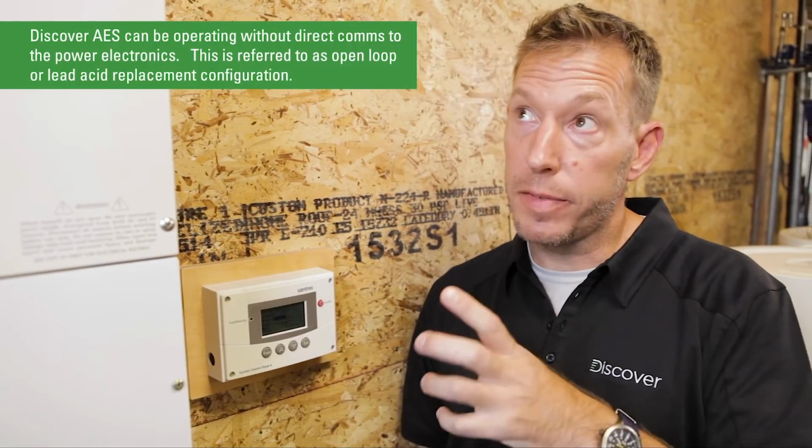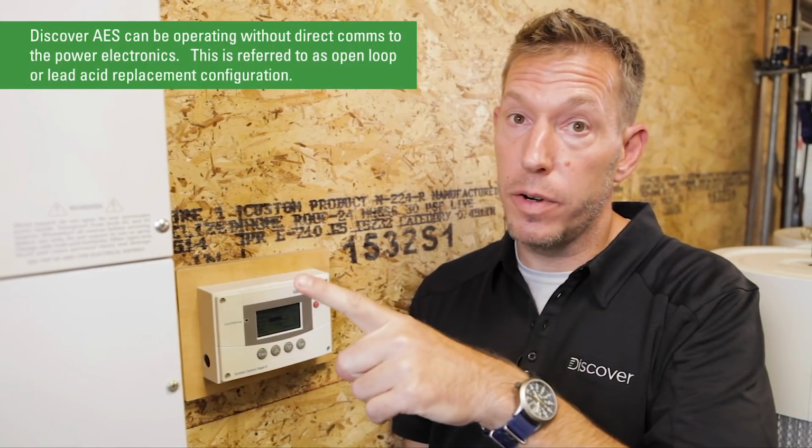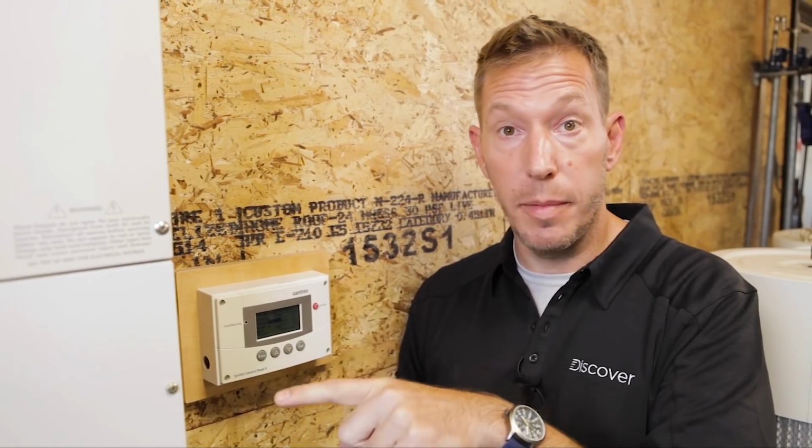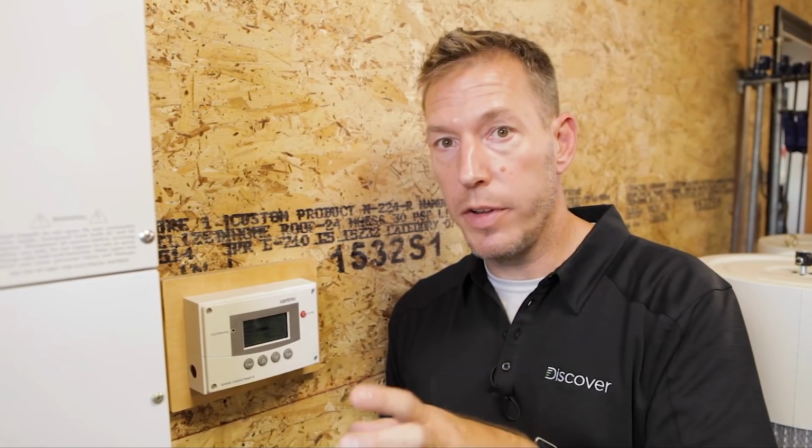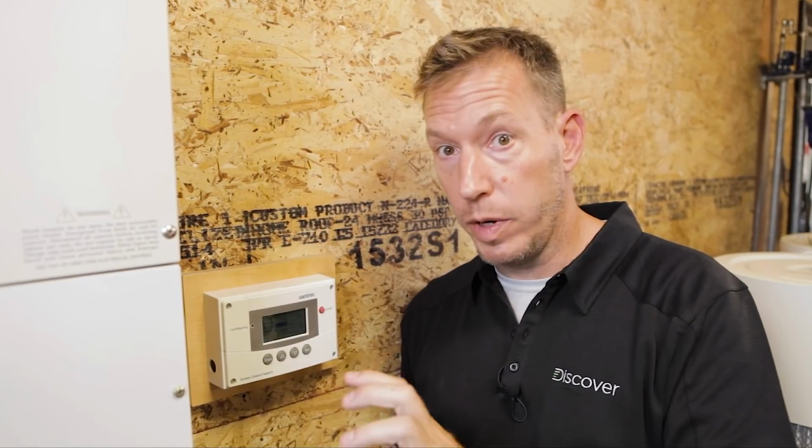The simple setup on these, again, this is Xantrex inverters, so they're pre-Schneider XW+. That would give you a good idea that if you were setting up a Magnum system or an Outback system or Morningstar charge controllers or Midnight Classics, whatever you want on your power electronics side, you don't have to have closed loop comms to make that happen and make the batteries really work for you.